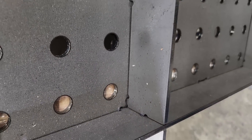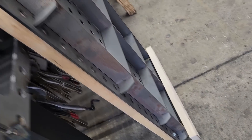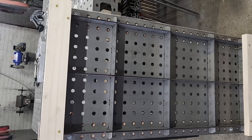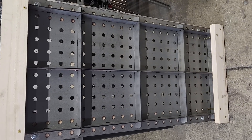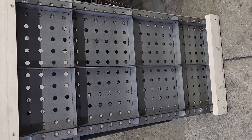The purpose of these ribs is to keep our table top nice and straight. It'll keep everything flat and rigid. That way, whenever you have a big piece or any kind of project you're working on across the surface of the table, when you clamp it down you're not going to be bowing it. You know that you have a flat surface to work on.